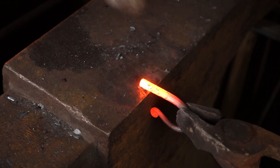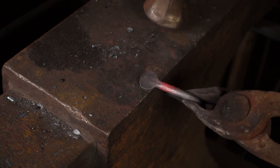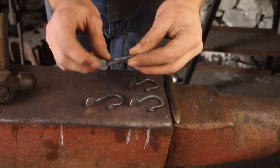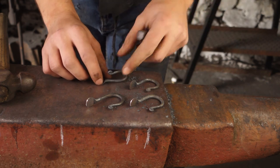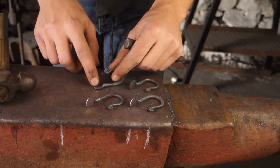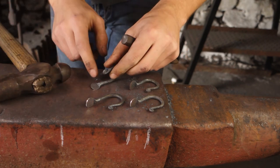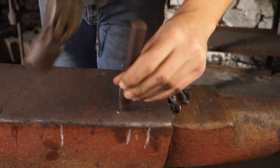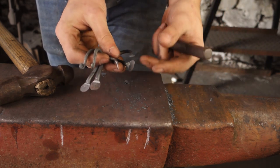So I've cut the hooks off the bars and I'm just going to come at the near edge and create an isolation. I've got the four hooks here but as you can see we need to put a hole in them so we can rivet them on to the back plate. I've got a centre punch so I can mark a hole and then I'll drill them rather than trying to punch them as they're very small. Make sure as well that it's running flat. So I'll drill them to 6.5mm as we'll use 6mm bar for the rivets.